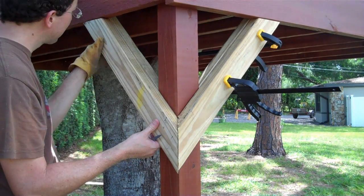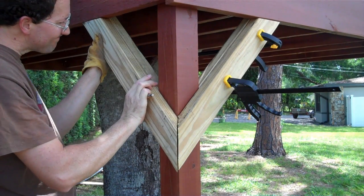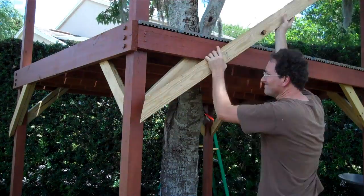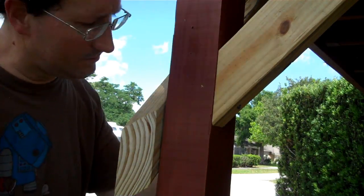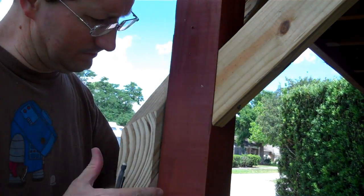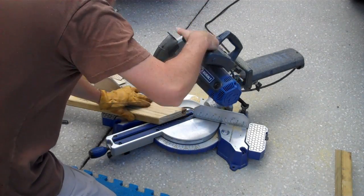It can be difficult to get a compound cut like this at the exact right length. You could use a measuring tape, but then you also have to get the angle of the cut right. Or you can just hold the board up and mark the approximate location and angle in one go. My recommendation is to test fit the compound miter cut to find out how much to trim off the other end, and then cut the 45 degree diagonal side to get the board to the right length.